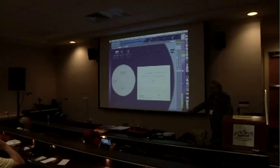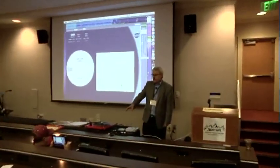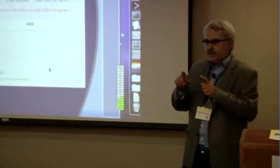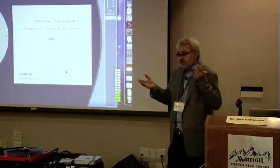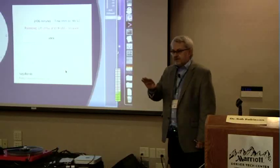Any other questions at this point? Yes? Just for clarity then, I'm just following on that last question. So coming out of the turntable, you have a small preamp. Yes. But no RIAA in that preamp. That's correct. What kind of a device is that? That's one of these devices that I was explaining earlier, these made for home recordings. There are tons of them out there, tons of different ones. And they typically have built-in preamps that are suitable for this purpose. They're quiet and they're really great. So whatever price point you want to go to, you're going to get spectacular results.